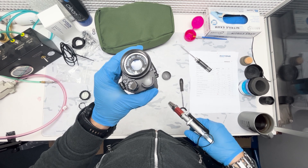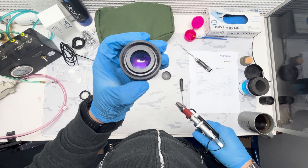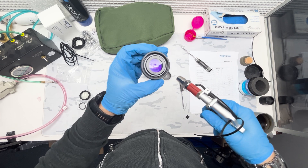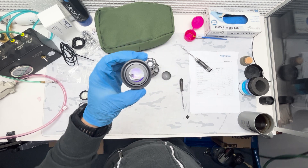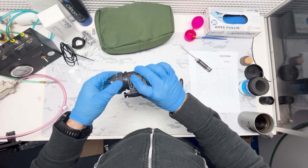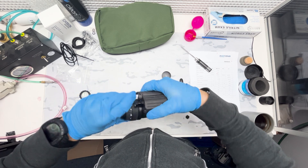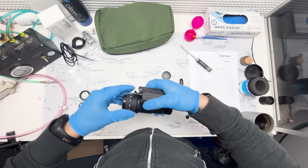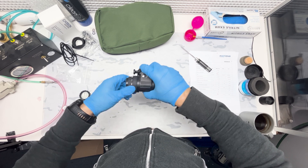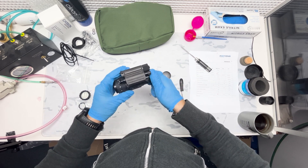Again, that's why I'm using gloves and hitting this with air so many times. You can also use camera cleaning brushes or microfiber towels to help with cleaning. We're going to hit the eyepiece with some air to make sure there's no debris on there and visually inspect it as well. Once I put these two things together there'll be two pieces of glass that won't really come apart unless it needs servicing - that's why I'm triple checking for debris. This just hand tightens back down. You'll feel the O-ring hit into the plastic housing and then tighten past that, then go to the eyepiece locking ring and tighten it back up. Just checking functionality, making sure there's no grinding with the objective or the eyepiece now that it's fully installed.